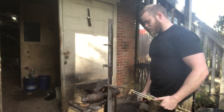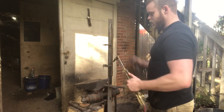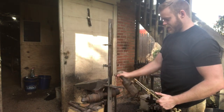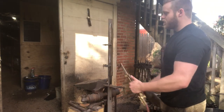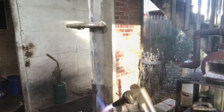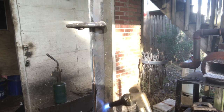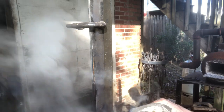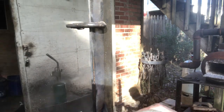Got the sword clamped up straight, looking good. Got the cutting torch here — going to put heat into the center — and a spray bottle to keep heat from bleeding into the edges too fast. We're going to bring the tang as well as about the first inch of the blade all the way back to a nice blue to make those good and springy. Hopefully that fixes the warp and gives us a good strong blade. Just working my way up the blade a little bit at a time, moving the clamps out of the way as needed, trying to get as uniform a temper as I can.